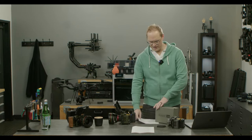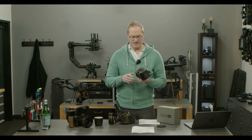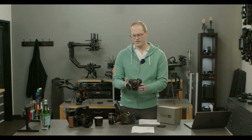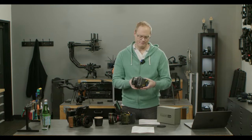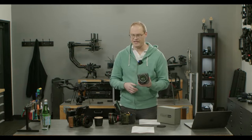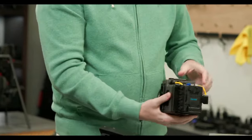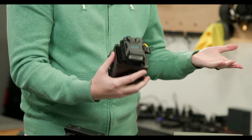Quick camera overview for everybody. If you don't know about Ember, this is the next in our line of cameras — it's a high-speed camera, it's very small. We've got three different models built up here, but the core package is about an 820 gram cube, about four inches. Key features: it comes with a locking E-mount, it's got internal four terabyte SSD good for about 46 minutes of record time, it shoots to Apple ProRes, and it's got all these nice I/O up at the top — power, Ethernet, HDMI, USB-C, and GPIO.